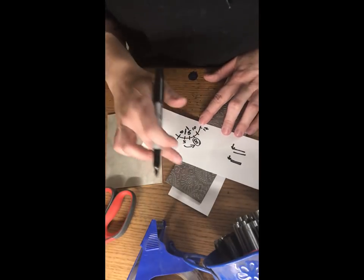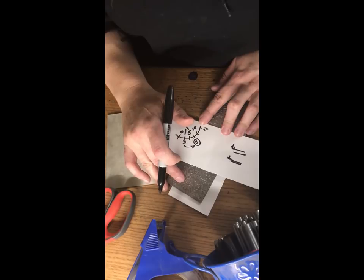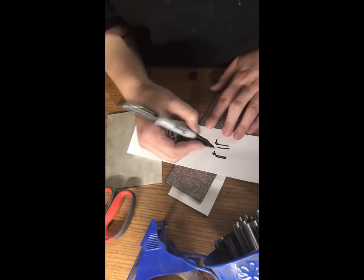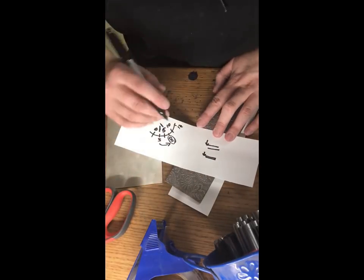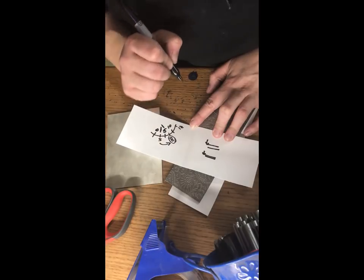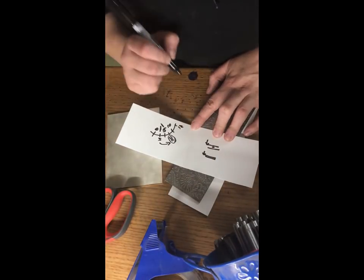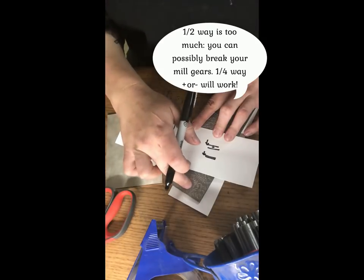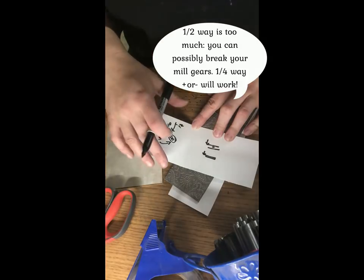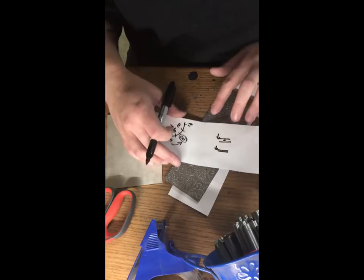Just make sure when you're doing this that it's going to be a little harder to roll. Always anneal your metal. For example, if I'm doing 18 gauge and I take it down to about an 8, my metal is going to be compressed not quite halfway into the divots. There's plenty of space in a lot of these — I've gotten to the point where they are so deep and clean and crisp, from end to end.